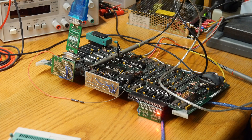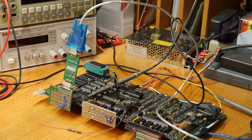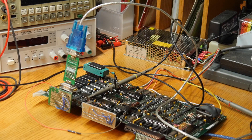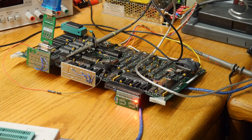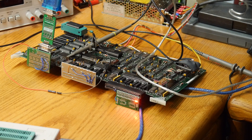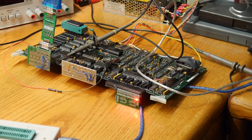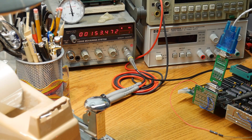I've been trying to get the serial port to work. I have a serial connection on the board now, one of the USB to RS-232 converters. I've put a scope probe on the baud rate clock that comes out of the 8253. I decided to run it at 16 times, so if I want 9600 baud, I need 9600 times 16, which is 153.6 kHz. I have a scope probe on there running into my frequency counter, and I get 153.47 — close enough.